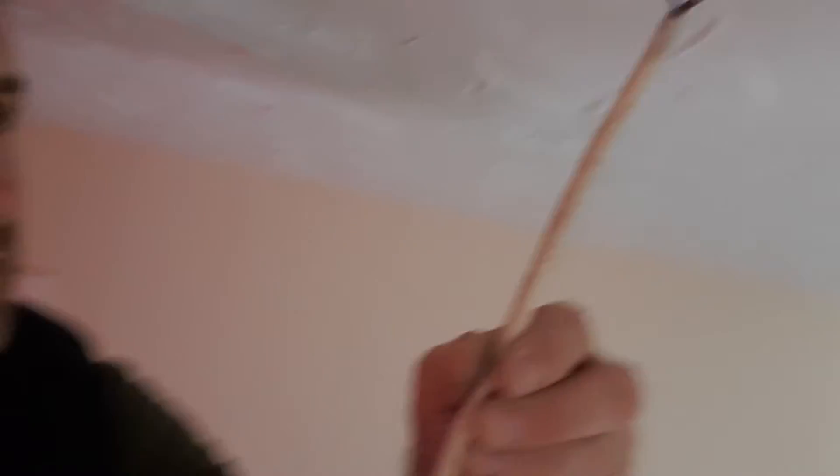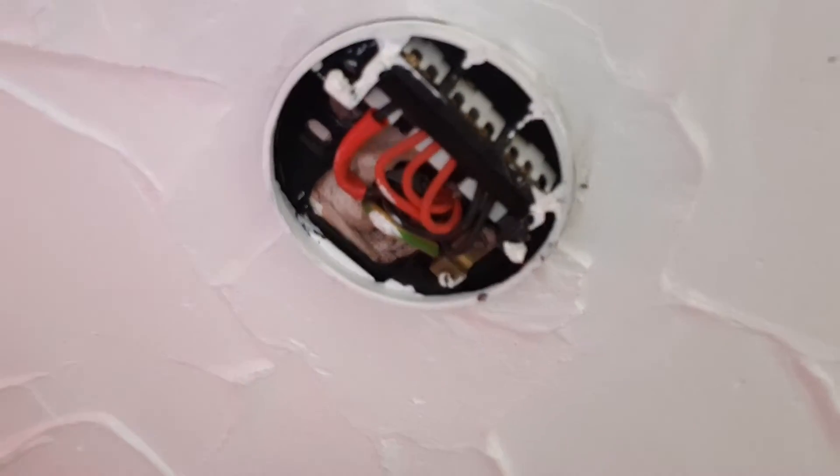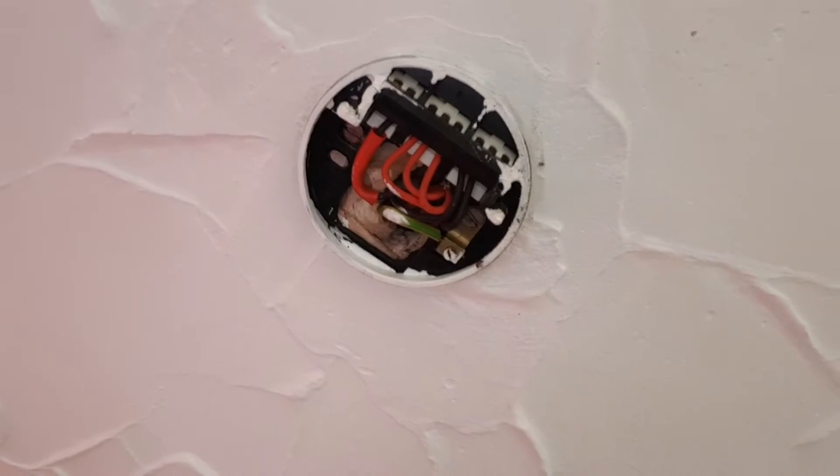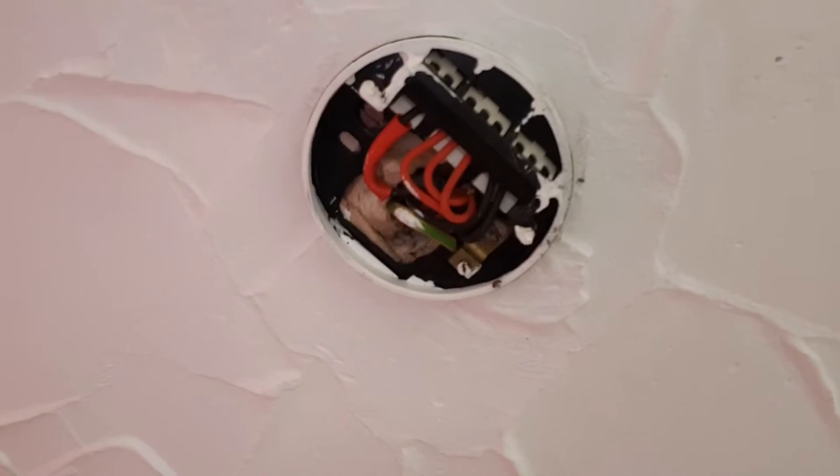I've undone it now. I'm only going to replace the pendant and leave the rose up there. I'll double-check every terminal, make sure everything's nice and tight. It's not really focusing on camera but you can generally see things are quite tidy — it's an old one but it's fine, a bit of paint all over, the usual thing.